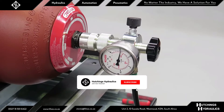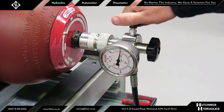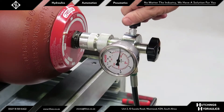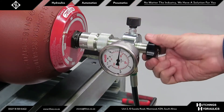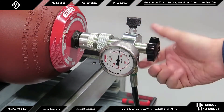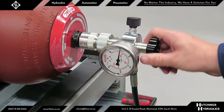The rate of nitrogen flow may only be increased once the bladder has inflated properly. Raise the gas pressure in the vessel to the desired pre-charge pressure, then stop the flow of gas by backing off the nitrogen regulator fully. Temperature changes may cause small pressure changes in the accumulator assembly. It is best practice to charge the vessel to a slightly higher pressure than what is needed, allow the vessel to cool, and then depressurize to the final setting slowly.